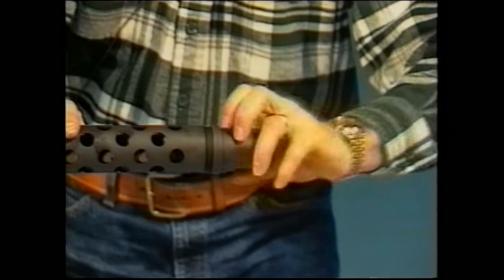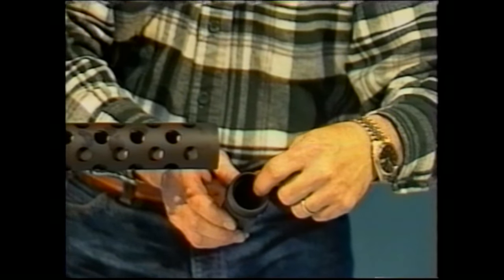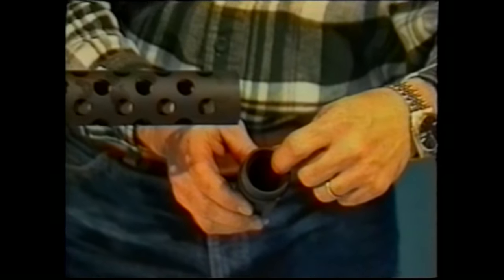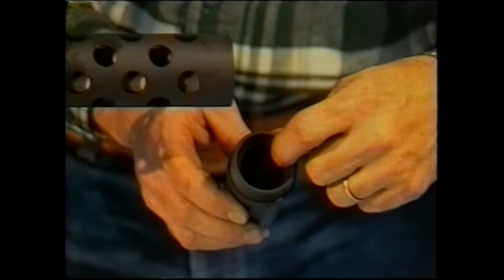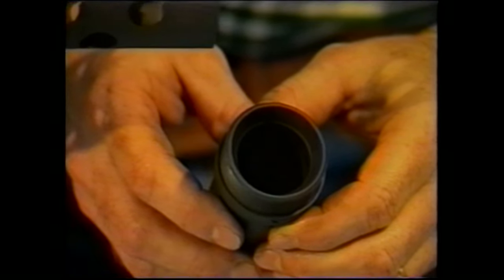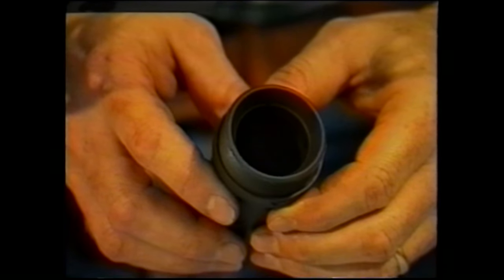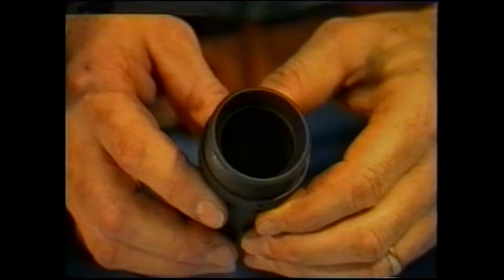There's a very important reason why you need to remove and clean the muzzle bearing. There is a close tolerance fit in the inside of the muzzle bearing to the muzzle of the gun itself. This close tolerance fit is necessary for the proper operation of the gun. The Browning light machine guns in air-cooled configuration utilize some of the gas pressure from the propelling cartridges to force the barrel assembly rearward and aid in recoil.